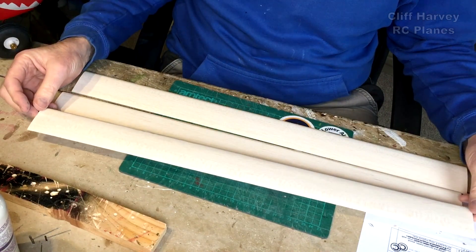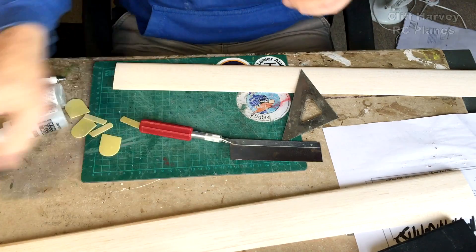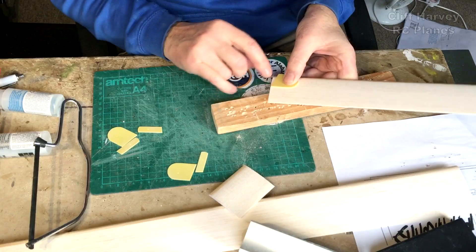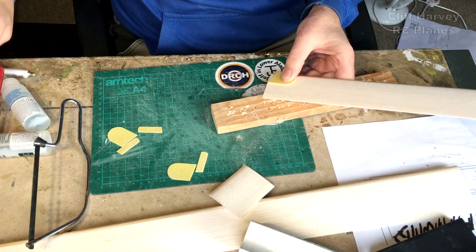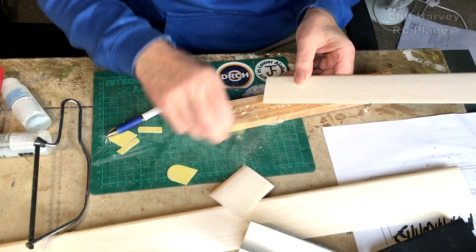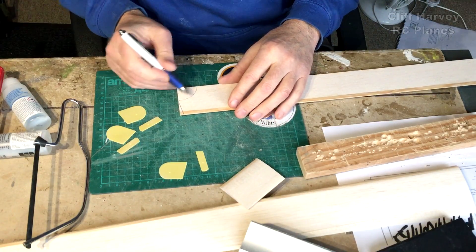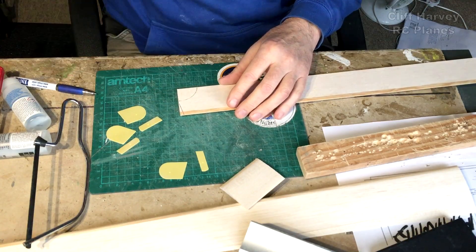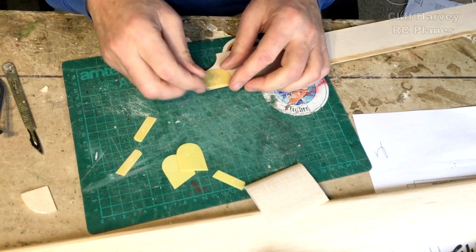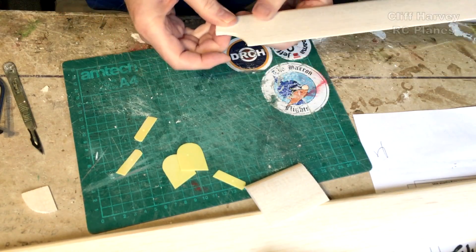I've got to balance them end to end to get the centre of gravity, and that way as well, make sure they're all the same. I've cut out my fiberglass pieces — these are the root blade reinforcements. You cut that at that angle and then I'm going to cut a big curve out of that as per the plan. This goes on the bottom; the little one goes on the top. This is what you drill through once you've got your centre of gravity on the blade. I have to knife that through and replicate it on the other two blades. Now I'm going to epoxy that onto there, cut the other blades to length and edge ends, and then I can get on with the blade balancing.